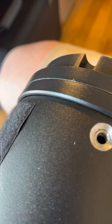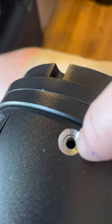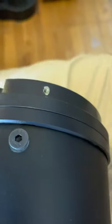I've countersunk not just the shell — this pipe, which is fairly thin, probably a little more than 3/16ths of an inch, so it could be called sheet metal — but into the hole a little bit as well, which is part of this pot metal extension adapter. What that does is it locks the two together with a cone shape, which is about as strong a join as you can get without it being able to wiggle around. I put that in and tighten it up.